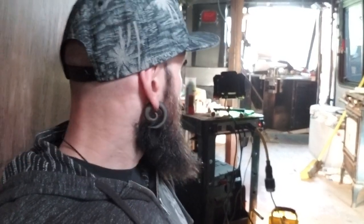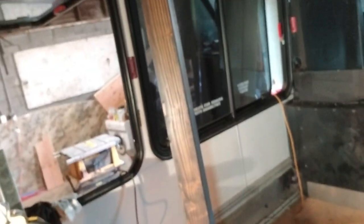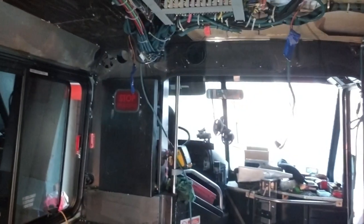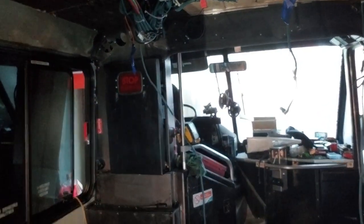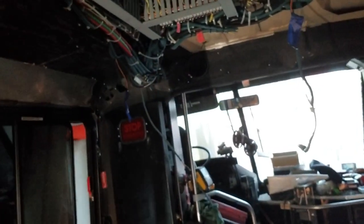Let's go check out what I've got going on. This is the pillar that's going to be one side of the doorway — I was able to get floor to ceiling in that one spot, which is good. But where the next pillar is going to go, it lands right where the electrical box is. So I need to have my plenum wall in first, so that when I run this wall off of it I have something sturdy to anchor to.